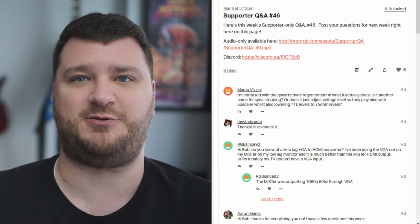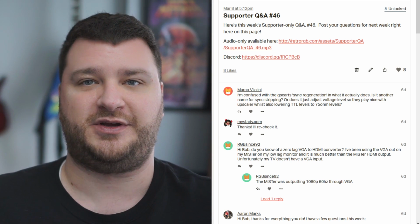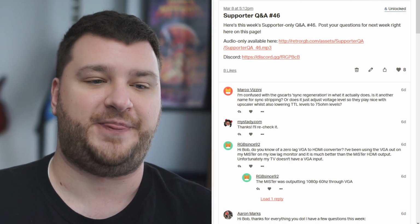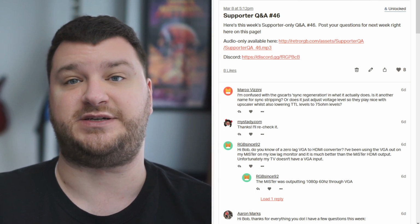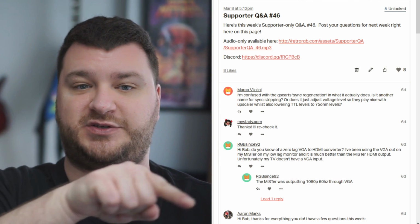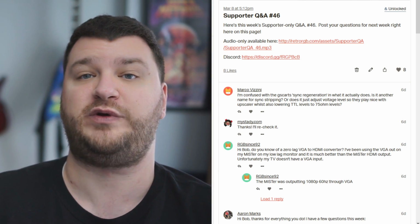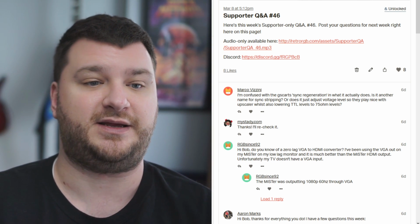Sync regeneration is almost like language translation, for lack of a better description. I could talk for a long time about this, so I'm going to try to oversimplify just to make it easy. But imagine, one device is talking in one language, another device isn't so good at that language, so there's an interpreter in the middle. That's essentially what it's doing. So the consoles like Master System, where if you were to put the signal on a scope, it's not a perfectly square wave. There's other stuff going on. So this sync regeneration reads that sync signal and then rewrites it to be a proper 75 ohm C-sync signal.